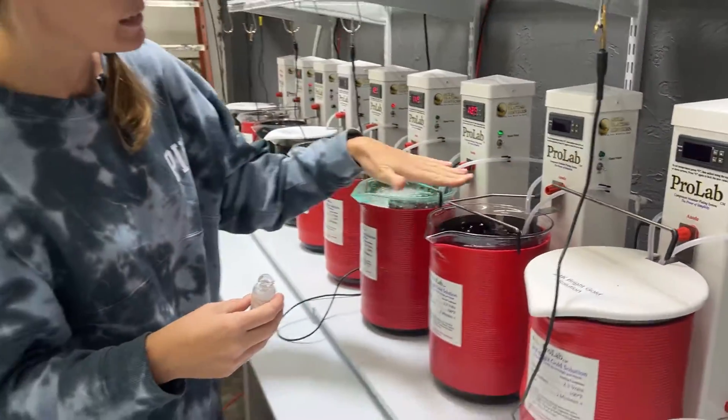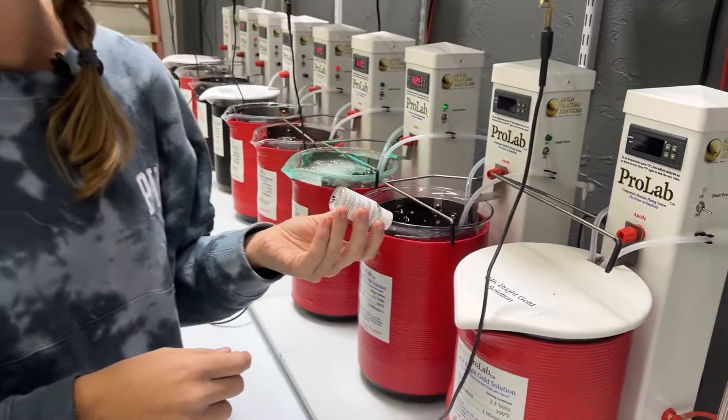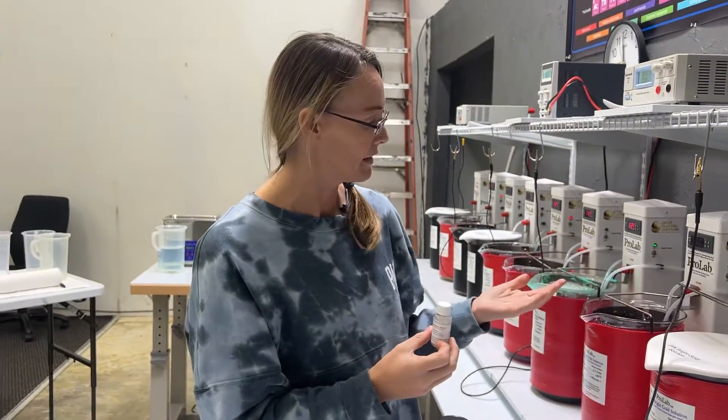You can see our solution level is pretty high. If I was having to add another eight ounces of solution to get eight grams in there, it's probably going to start bringing my levels up a lot higher than I would like. That would be a situation where you would say, let's do a high concentration of gold — simply put a note when you check out, or tell one of our customer service associates if you place the order by phone. A couple other things with our gold replenisher: it slows down your depletion rate, but it is important to have proper gold bath maintenance.